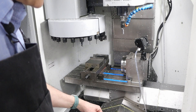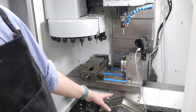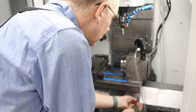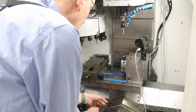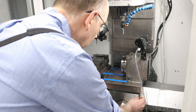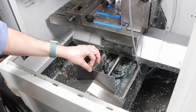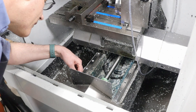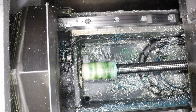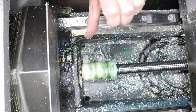So what I'm going to do is pull off these way covers. As I understand it, the inductive sensor should be under these way covers. I took this part of the way cover off and looking down here — right here is the inductive sensor and you can see there are some chips. Let me grab them right there.